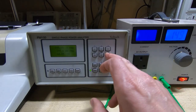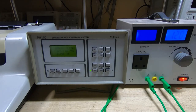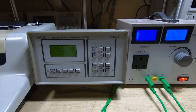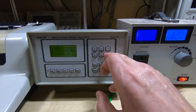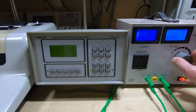Going all the way down to 120 volts — as I said, the typewriter will still work at this voltage, and pressing a key confirms it's still working fine. Our power factor is now down at 0.762. Looking at the power drawn, average power has dropped because the incoming supply is lower and there is some linear regulation in there too. Looking at the VA, we're now up around 40 VA, so we're well away from the ideal operational range of the ferroresonant transformer.